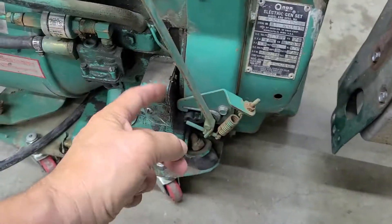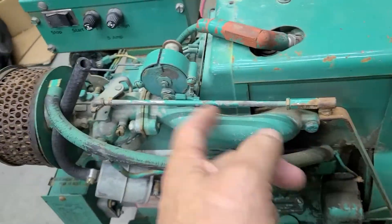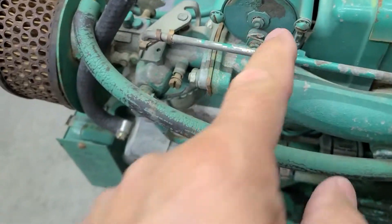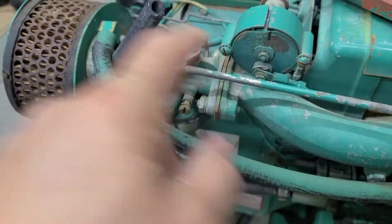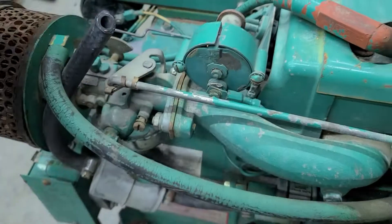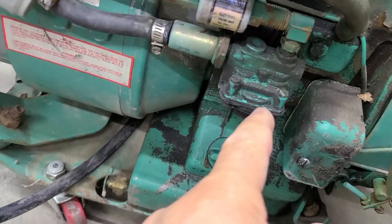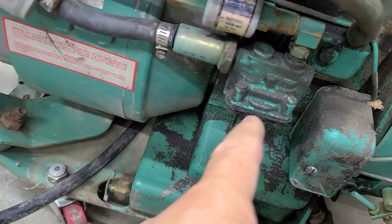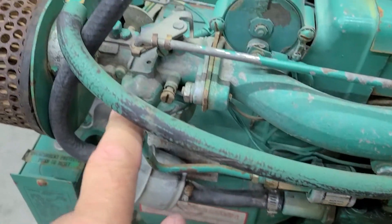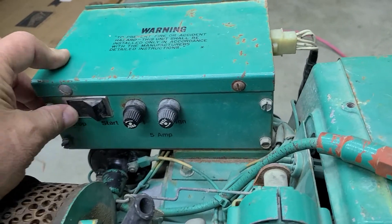It's got a fan on this end, and then this is the governor that runs on that — this sets your speed and runs your throttle. Inside here there's a choke, which has a circular fiber thing with nichrome wire on it. This runs over to 12 volts and heats up that nichrome wire to open the choke. Down here we've got the fuel pump regulator, and then this is your shutoff valve for the fuel, which runs up here into the carb — and obviously the air cleaner.